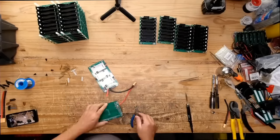The cool thing about this one battery is that the way that I'm going to do it here, as you will see later, it will require you to modify your Delta, but you don't have to. You could also use it as a solar charger, right? So this battery, you connect it on that port, that goes on your Delta, and you could charge it. The only thing is that then you'd have to figure out an external way to charge the battery. The way that I ended up doing it with the hack here, it just becomes an extension of the internal battery, and so you can charge it with the Delta, charging either from solar or from the car or from the wall or whatever. So that's pretty cool, and the mods are not that difficult, actually.